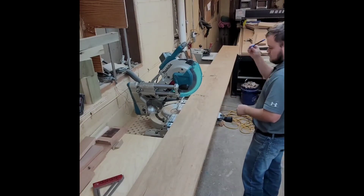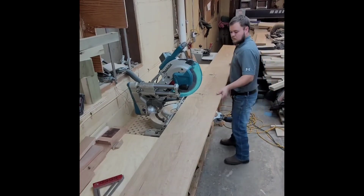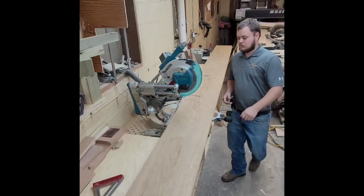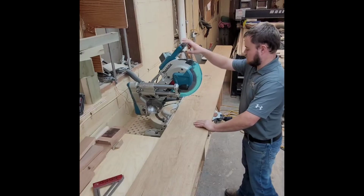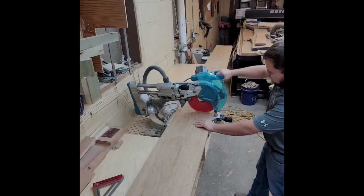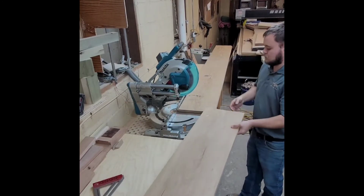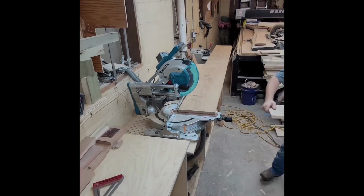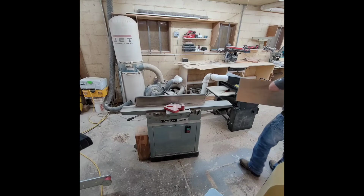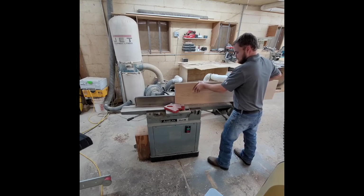We're going to be making a grain-matched white oak floating mantel. The reason I'm making it is because my friend couldn't get it cheaply at a big box store. So I'm using wood sourced from my cabinet shop. Right now we're just milling the lumber, getting it straight on all the edges so we can glue things together.